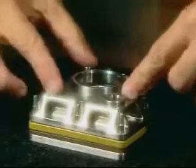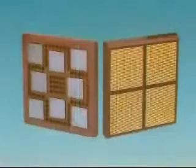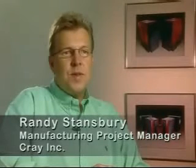The 350 pounds of force is then applied to engage the compliant interconnect to the PC card. Springs and C-clamps are then installed to hold this in place. We've taken more advantage of our suppliers with SV2 — for example, IBM, with the multi-chip module technology, the substrate, the chips connected to the substrate, and the spray cooling. IBM has a great track record for quality and reliability, indicative of our SV1 product. We have 8,000 plus hours per system on average of reliability, which is great for the supercomputer line of products.